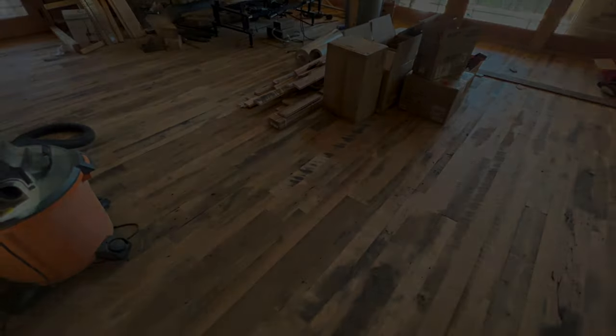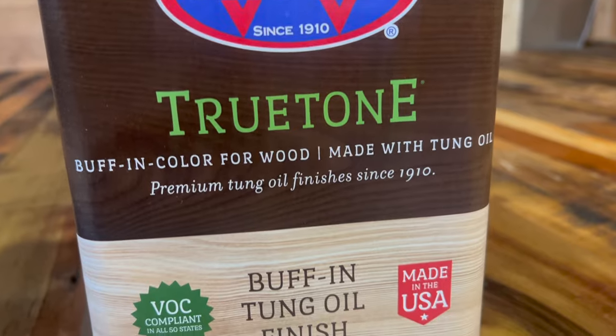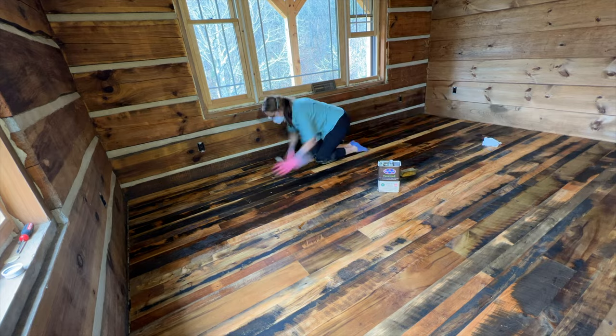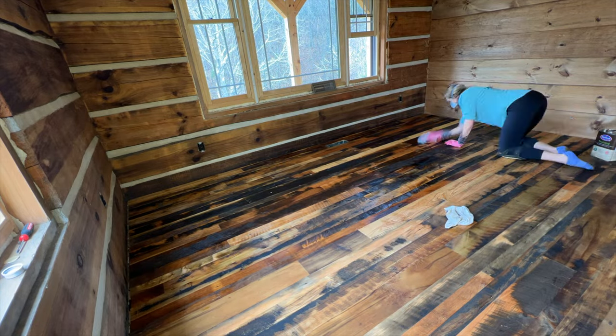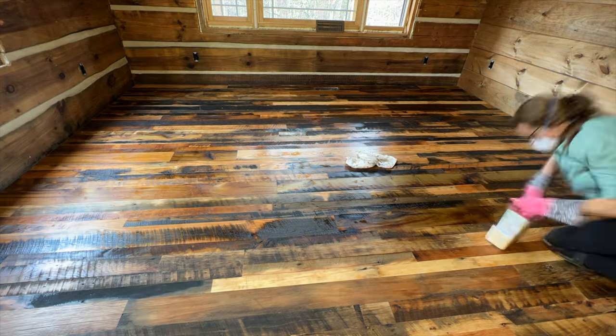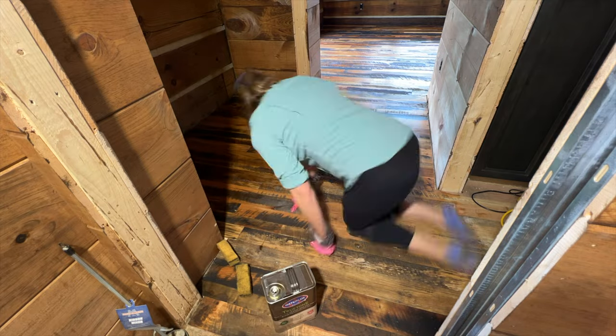We kind of overloaded the master bedroom with the dark pieces. After applying the tung oil I let it sit for about 48 hours, and then I came back with the tung oil finish and applied the first coat. After drying for about every 10 minutes in each section, I had to go back with a clean cloth and smear it in to get it really even looking. Once I finished that first coat I had to wait another 24 hours and then apply the second coat. Hopefully the wood is really protected from any future spills and will look beautiful for many years to come.